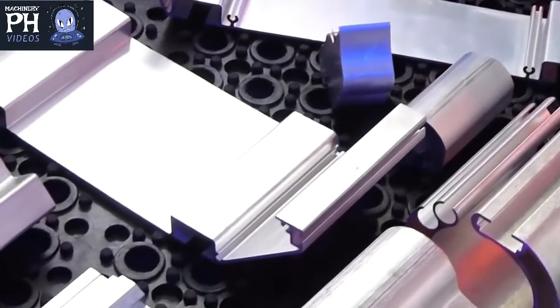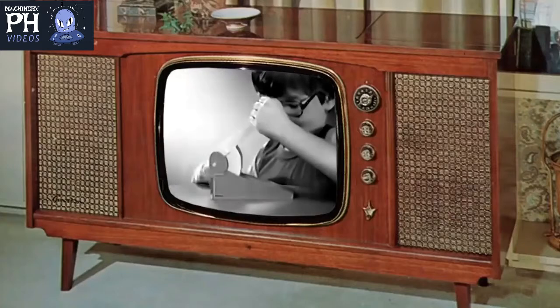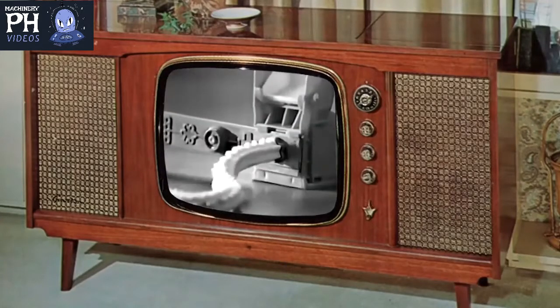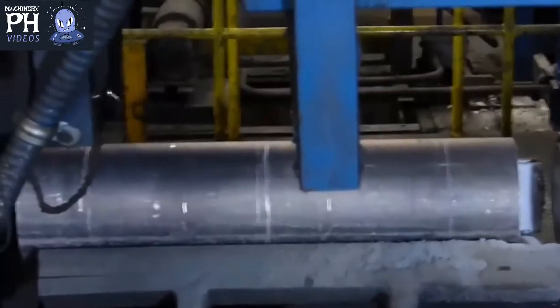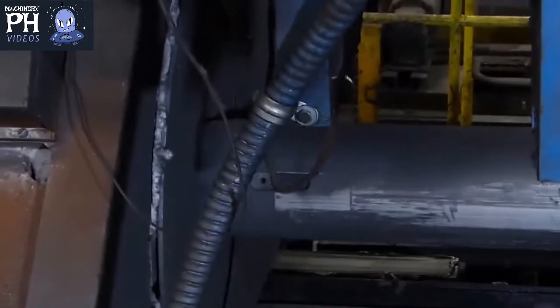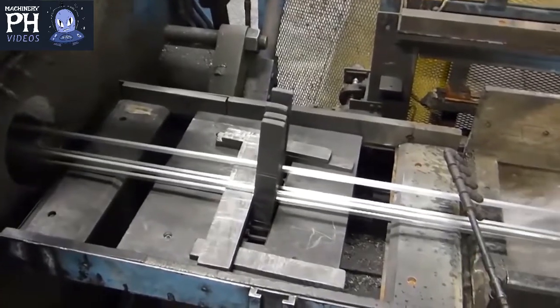Your earliest exposure to extrusion was probably when you first forced modeling clay through a toy press like this one. The shape or profile of the clay is resultant of the opening shape it was forced through. The aluminum extrusion process relies on a hydraulic press to push aluminum, heated to a malleable yet solid state, through a steel die. Let's take a closer look.